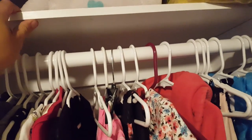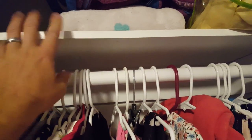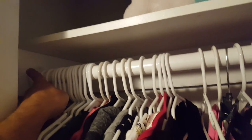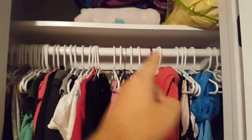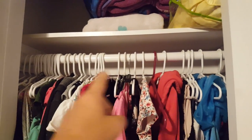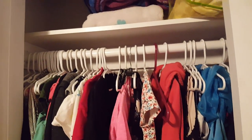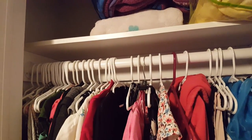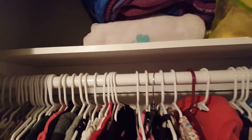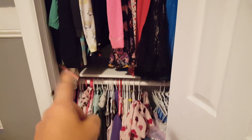The shelves I reused — I think these are some type of melamine board, a three-quarter inch melamine. It's pretty strong. And around the edges there is three-quarter inch plywood. That's all secured into studs underneath the shelf on three sides, two studs on the back and two studs on each side, with two-and-a-half inch deck screws. I puttied over all those, and then everything's painted so you can't see the screw holes at all. Very strong — I mean, you could hang from that stuff, you could sit on these shelves. They're super strong.